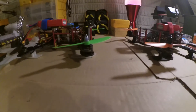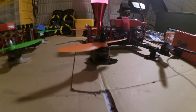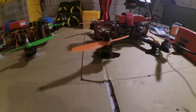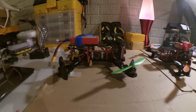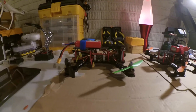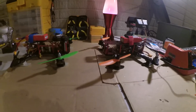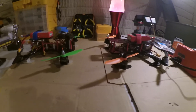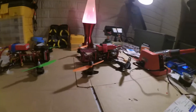The motors are pretty much the same size. The Hong Kong kit has EMAX 1806 2280KV motors, and the Mini Quad Bros kit has DYS 1806 2300KV motors, so a little more headroom there as well. On the Hong Kong kit, based on the seller's description they only support 3S, so if you want to run a 4S battery you won't be able to do that with this particular kit. One of the themes here is that the Mini Quad Bros components are higher quality overall and there's more room to grow, including the ability to run 4S down the road.